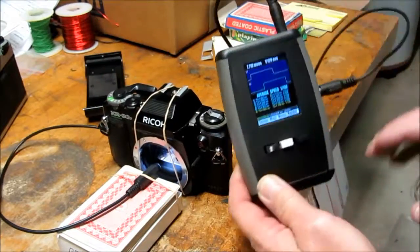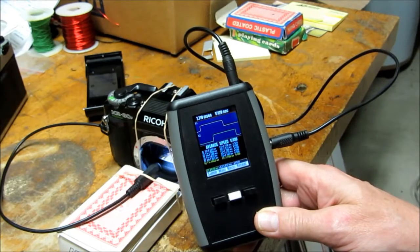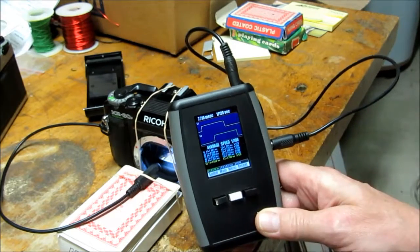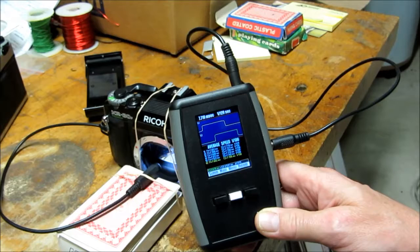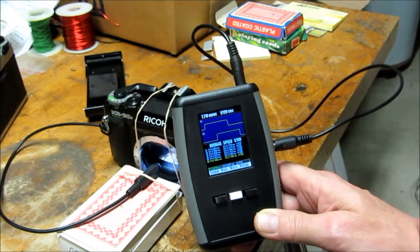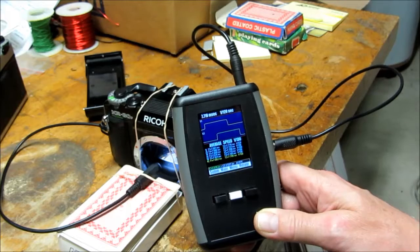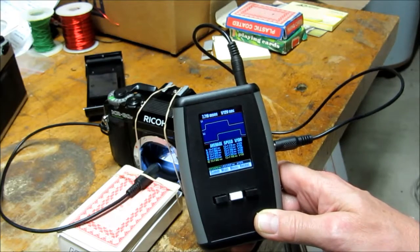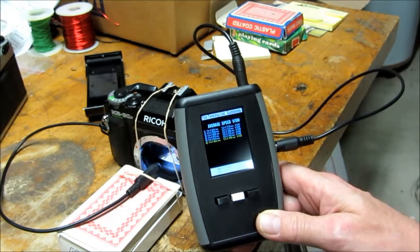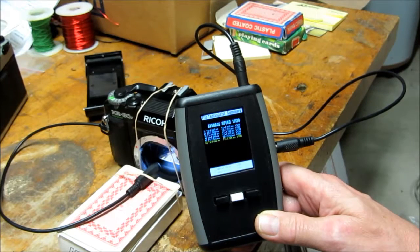When you're all done you'll see that all of the tests are recorded — the previous 16 tests. At the bottom there's an indication of your curtain speeds: curtain speed 1, curtain speed 2, which one is greater and by what percentage. The waveform shows the two sensors' received signal. The overlap shows how long each curtain was open. If you press the summary button you can see how the last tests went — the average speed, and the minimum and maximum speeds recorded.